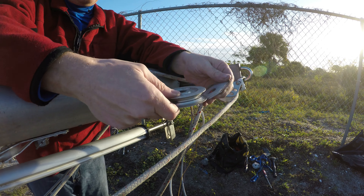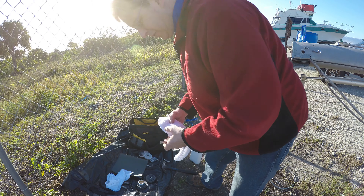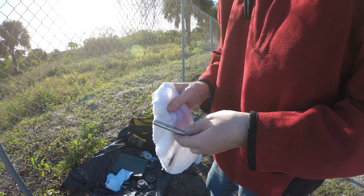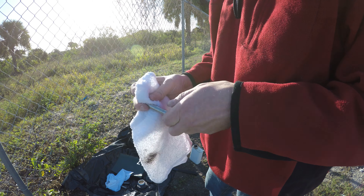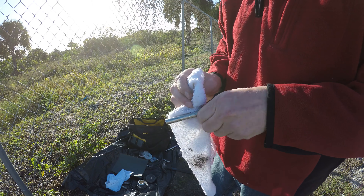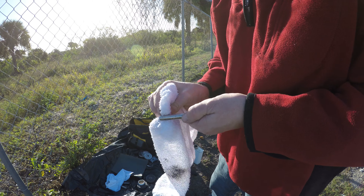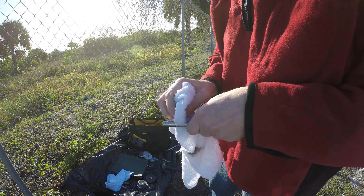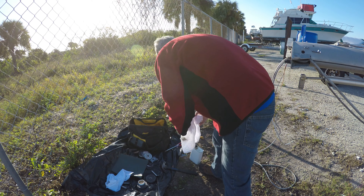Previously it was just these and they rode on this bushing, with little plastic pieces on either side to reduce friction. I'm using a little bit of acetone to clean some of the gunk off these pins before I put them back in. They no longer are a bearing surface because the hubs on these new sheaves don't turn. I figure a couple of minutes of cleaning might save me 15 minutes or an hour of banging and cursing while I try to reinstall them.